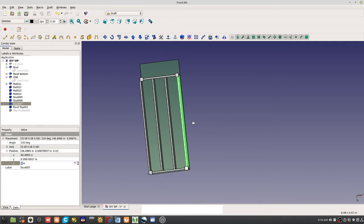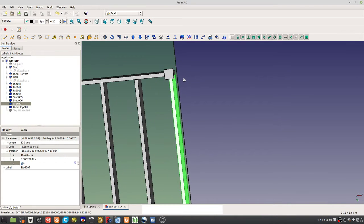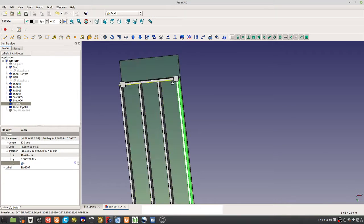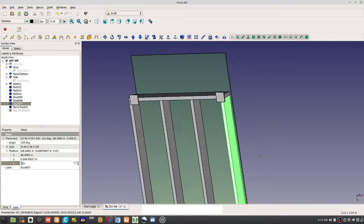What do you do about corners? The corner modules would also want a mechanism where you slip in a panel. We'd design a special corner piece — maybe the protrusion coming out, or like the specialized corner panels we built before that have siding on them so the adjacent panel fits into the slot. We might put OSB on one side and make the notching and slotting system happen on the corner. A little bit of detail there, but not much to worry about.